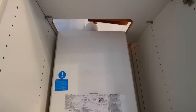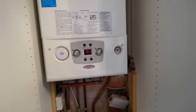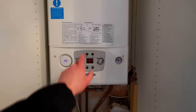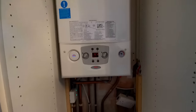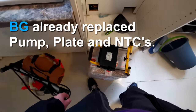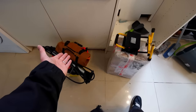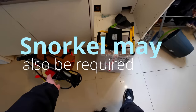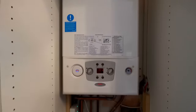Okay so here we are today on this Alpha Eco 2 Plus, which I believe is the same as the Intech 2. I've got to do a main heat exchanger on this boiler - it overheats when it's used for hot water for any real period of time. I've got just my hand tools, pump, heat exchanger, a torch, a head torch, some towels, and once it's done I've got to set up the combustion, gas rate, and all that stuff.